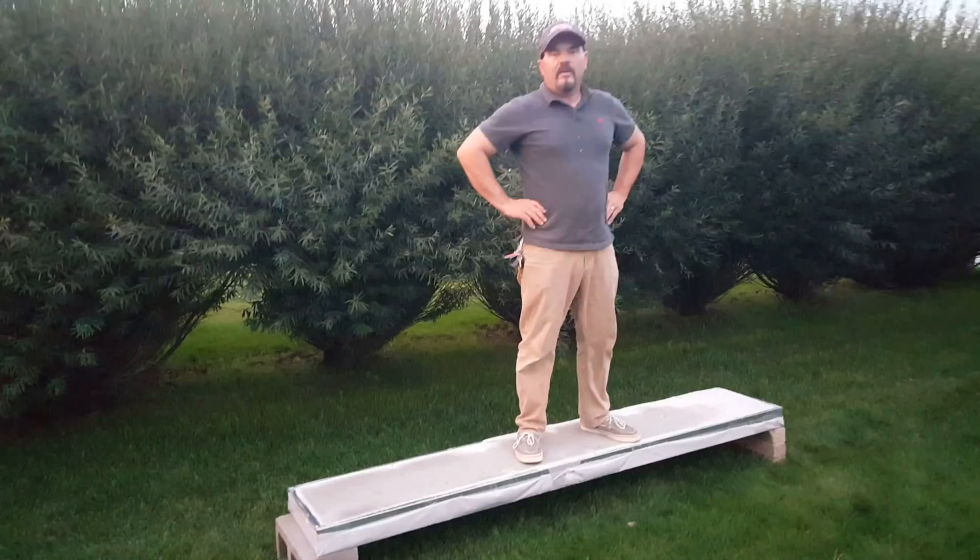The other night I said, 'Come here, babe.' I propped one edge of a panel up on another panel and said I'm going to stand on it. She's like, 'What if it breaks?' And I'm like, 'Well, if it breaks, it breaks.' I bounced on it and it didn't break. She came up and got on it with me, and then our boys came up and got on it. It just prompted me to want to do a flex test and show you guys how strong you can make aircrete and that it is a viable building system for putting up wall panels and roofing systems.